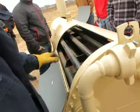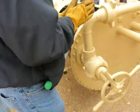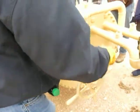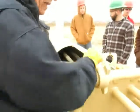Okay, so we made a pass. Our gas line now comes through here. Now I can choke it. This is going to tell me how many 64ths of an inch of choke I've got open. I can regulate the flow. The heat of the tip of the choke is all the way inside the water bath, so it stays warm. So it's going to put enough heat in there for me to choke it. Then after I choke it, it goes out of the choke, back in, and makes some more passes, and then comes back out and goes to the rest of the system. So I'm adding enough heat here. If I take additional pressure drops through separators, whatever else I've got downstream, I've added that heat there to melt the hydrates.